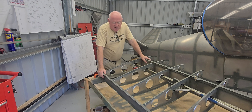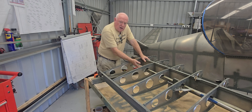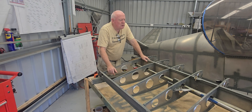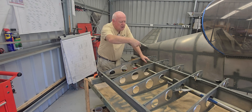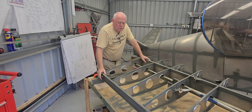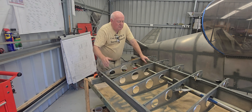I'm ready to start skinning the underside of the right-hand wing. I've basically riveted everything — all the ribs are done. I've installed the conduit and cable route for the navigation and landing lights, put in the pitot tube and static tube up on the leading edge, the tie-down bracket is done, and the main aileron push rod off the control stick is in. Deburred everything, primed everything — so it's now time to put the skin on and start riveting the underside.